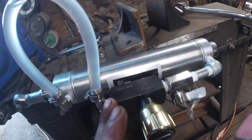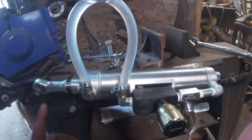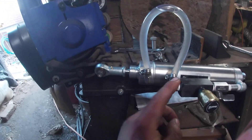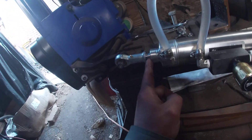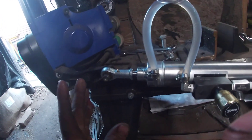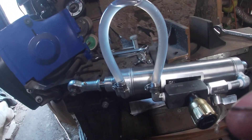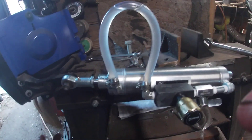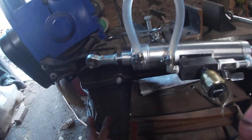It is one-and-a-half inch bore with a five-eighth inch rod. The knuckle did not come with it, and if you buy a pneumatic cylinder without the knuckle, the rod will be threaded. You'll need to identify the thread — either by matching bolts to it or using a thread identifier tool, which once you have one is indispensable.